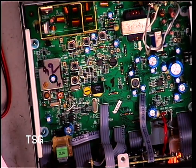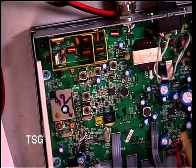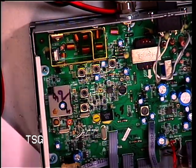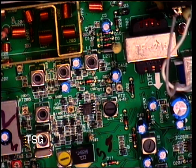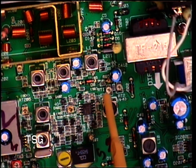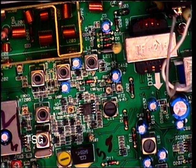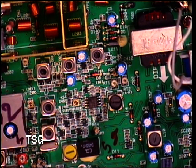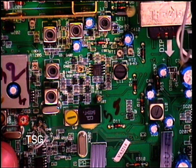Had that been needing adjustment, I will just tell you which one it was. It's the one next to the transformer there. I'll just zoom in to help you — the one to the left is the Squelch preset. Now it has an auto Squelch position. I'll switch it to auto Squelch, which is now on. Let's see how that works. Well, it comes in at 3 microvolts and it goes off at about 1.2 microvolts.